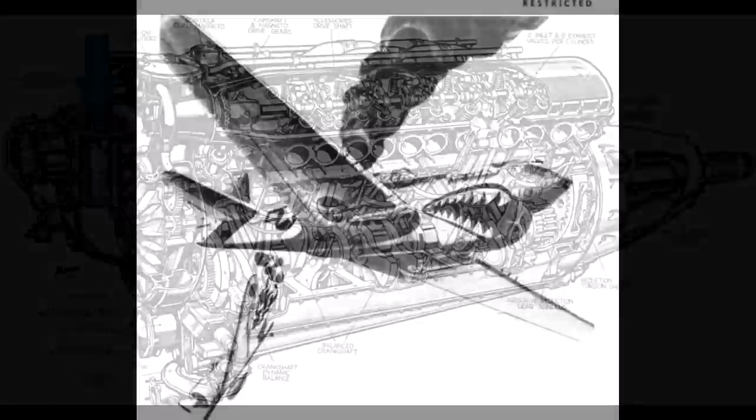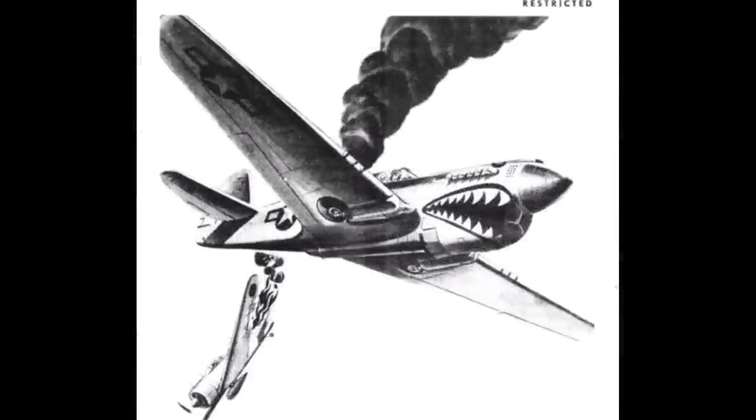Some early aircraft relied entirely upon the pilots to avoid overboosting. They would simply do this by looking down at the manifold pressure gauge as they moved the throttle lever. Most mid and late war aircraft had regulators to automatically regulate maximum boost. In the event of a dogfight, it's a big disadvantage for a pilot to have to look down at the gauge all the time. It's easier if he can just shove the throttle lever to the forward stop and let the regulator give max power, so that's what most planes did, certainly by 1943.